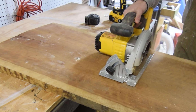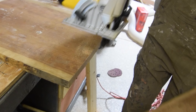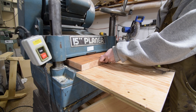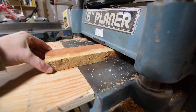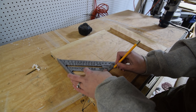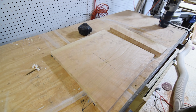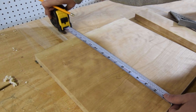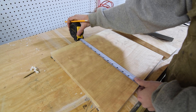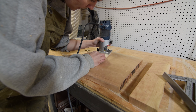By 15 inches, then I used the planer to flatten the cut piece, as well as an off-cut I'll use for the knife later. Once prepped, I found the center point of the square and also roughed in where I'd put the handle. With a trim router and a circle cutting jig, I used three passes to cut the circular shape from the cherry blank.